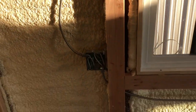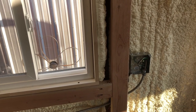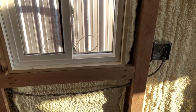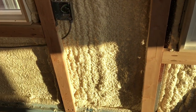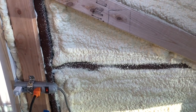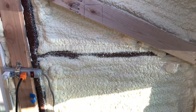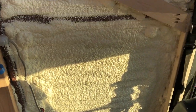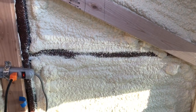That's the circuit for the microwave, and I think these both have to be GFI ground fault circuits because they're on both sides of the sink. I don't want to drape a cord across the sink if I have a rice cooker or an instant pot on one side or the other. Today I've got to run another circuit down here to the end of the couch, and behind the driver's seat is where the TV mount goes. I got the mount yesterday and put it on the back of the TV. I need to put some blocking down this way and across that way for the TV mount, and for the outlet at the end of the couch, plus one up higher for the TV so the cord doesn't hang down.